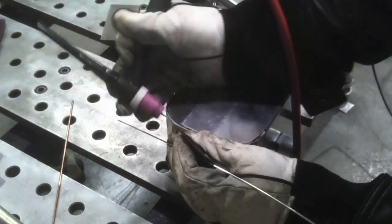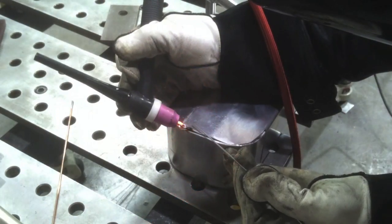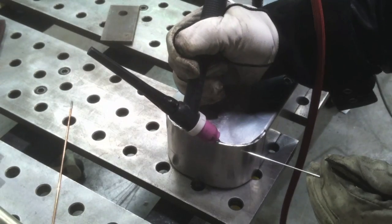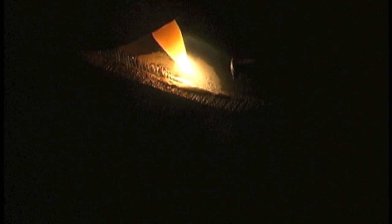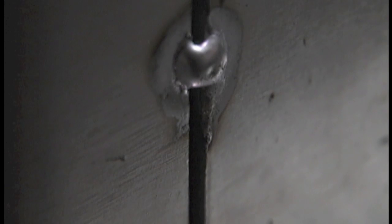For tacking, I'm going to get this thing as even and close as I can. Oftentimes I'll prop the cup right directly on a joint like this and put a little pressure on it to close up a little gap while I'm tacking — an easy way of clamping everything tight from every direction. This machine has a nice low start, low enough that it has a hard time jumping the arc off the tip. On this particular joint I could have done it with a 1/16th electrode, but there are certain areas that get thicker, so 3/32nd is a better all-around choice. It just wanders a little bit on start until I get it up to about 10 amps where the arc will pop off the tip. Getting lots of tacks on this thing so I don't lose the fit-up.